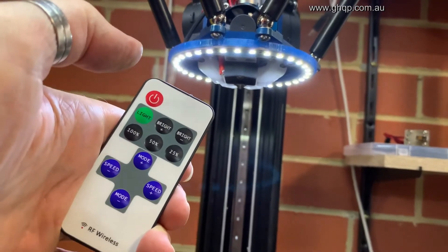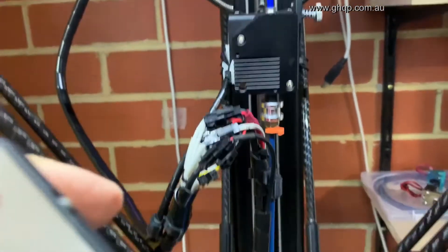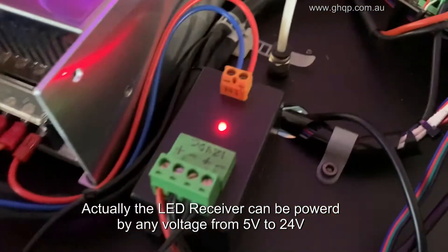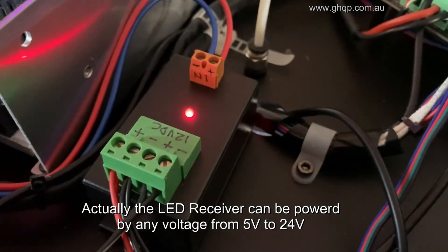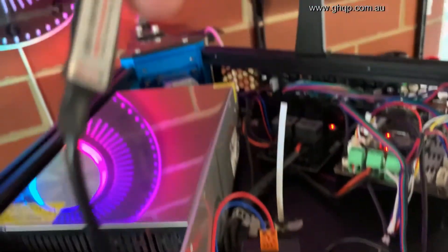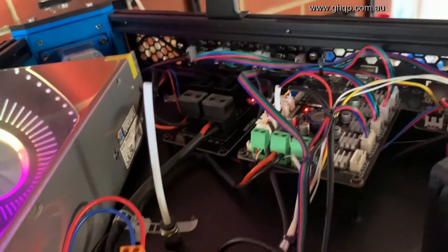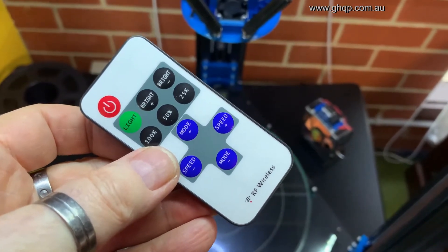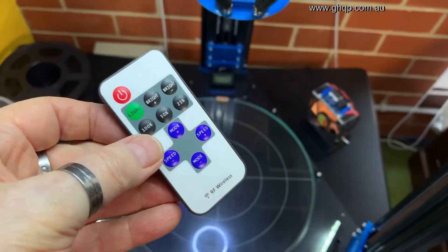That's the RF wireless remote. If we go up here, I've routed the cables all the way through. In the top here — it's a 12 volt system — I already had a buck converter installed to power the other lights at the bottom, so I just wired in, and this is the wireless remote control receiver there. That just basically goes in series with the power and then down to the halo light on the hotend. It's as simple as that. These wireless remotes are available from almost anywhere — AliExpress, eBay — I had this one for quite some time just waiting to be used.